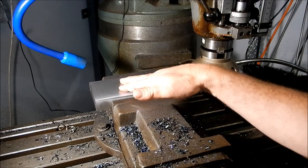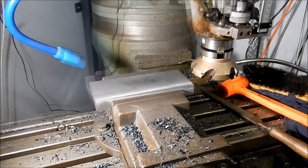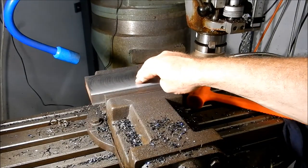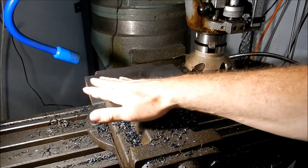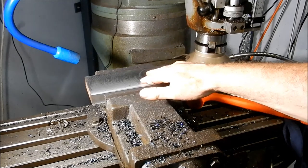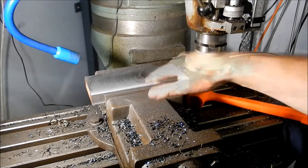That's a beautiful finish there. We'll flip that over and bring it back to thickness. Measuring up to about 23.15 to 17, so I'm parallel within about 0.02mm, which is plenty good enough for this. Going to take a cut of around about 0.13 and see how it goes.